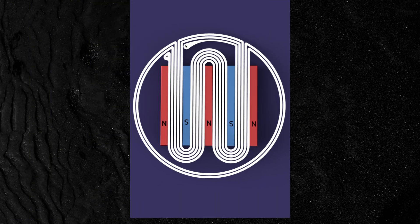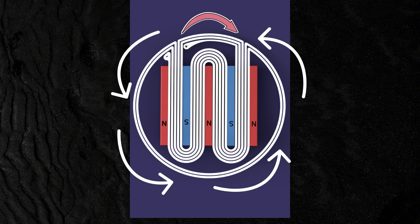This voice coil is my second iteration and it is a lot more efficient. It has an even larger membrane than the other one and also has one more trace. I made the coil a little more space efficient by shrinking the actual contact points for the bolts — these are about two millimeters wide, down from about four on the previous membrane. But the main thing that makes this coil so efficient relative to the number of traces is that I split the coil up on two sides. That is the best way I can explain it.